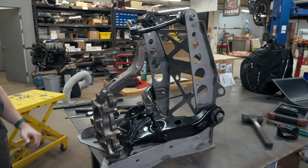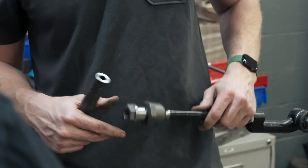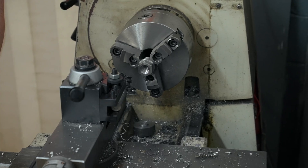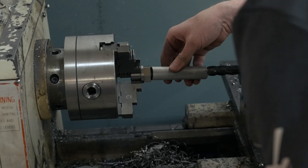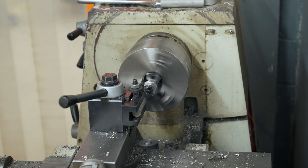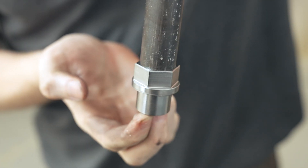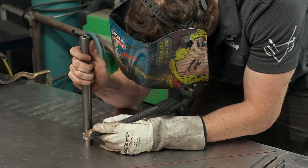It's going to be interactive. Doing projects like these you really have to get creative with parts and pieces. The first thing I did was grab a smooth adjuster that I could re-thread into the same thread as the inner tie rod, and then I hopped over to the lathe where I bored open the smooth adjuster to accept what I was going to use as the steering shaft or steering ram. An end mill was the fastest thing to use — there were boring bars, but it wouldn't get a perfectly square corner like I wanted. Once I finished, you can see how nicely it fits on the tube. We're going to TIG weld this up and it'll thread onto the inner tie rod — now we have our simulated steering rack.